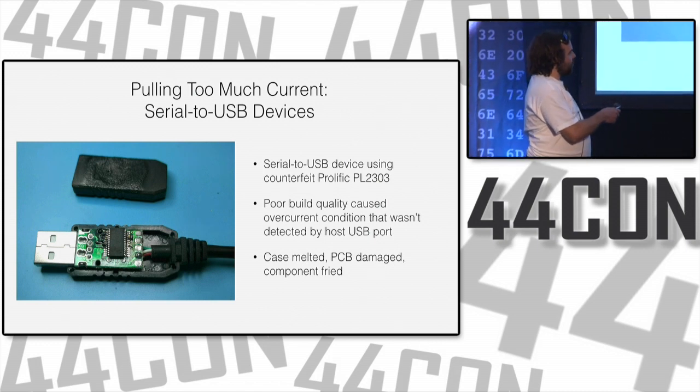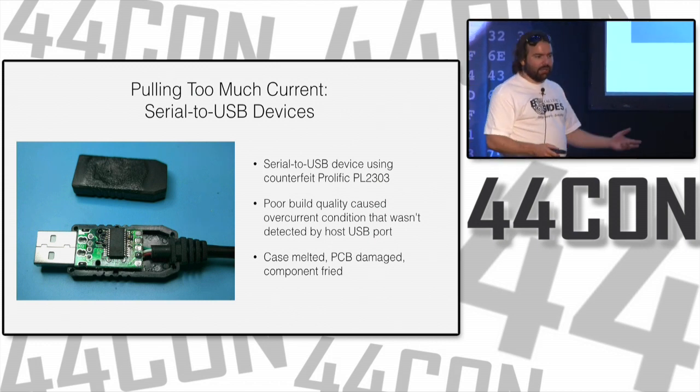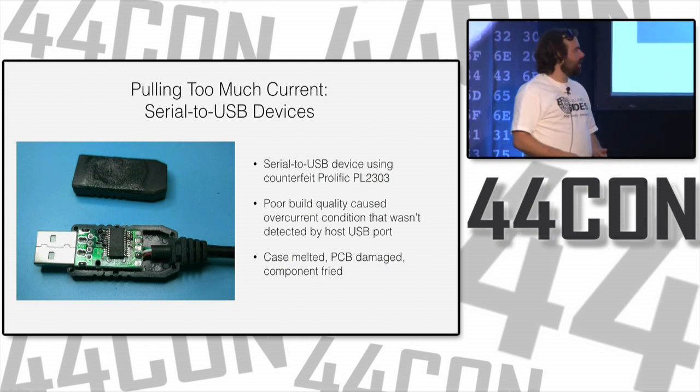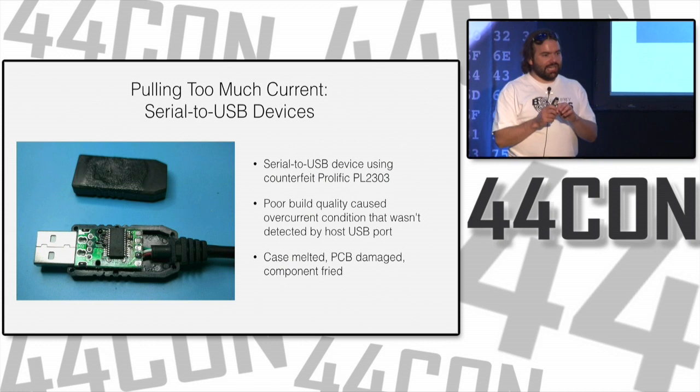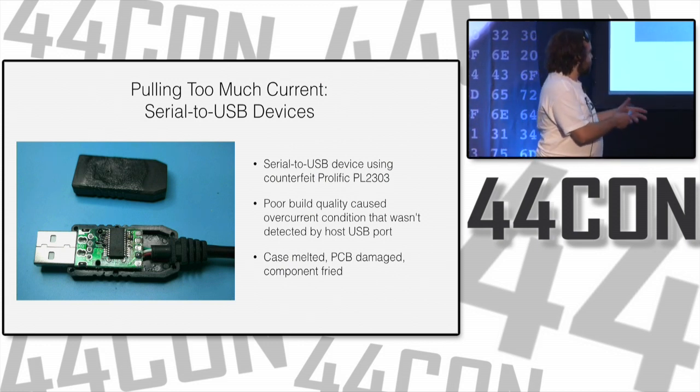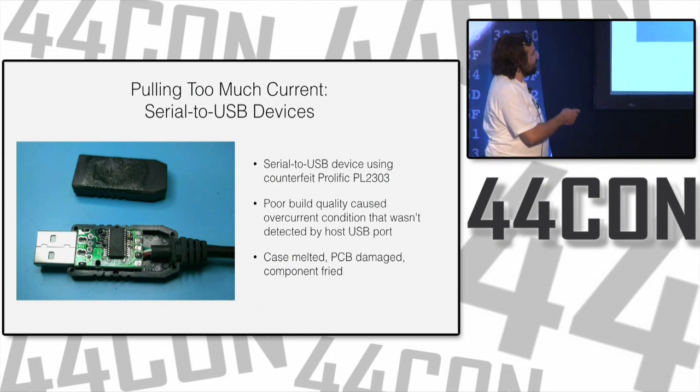Normally, the problem is like you hook up the red wire, which is power, and the black wire, which is ground. You hook those up to your Arduino board or something else that you're programming. And if you accidentally touch those together, you're drawing current and you're throwing it back down the other way, and you're getting things hot. It could have also been, because it's centered around here and there's nothing significant around here, just a blob of solder that was left on the board from manufacturing, and it just shorted something out and melted.